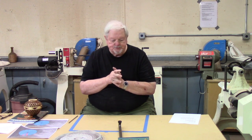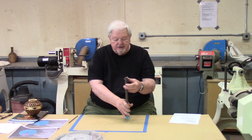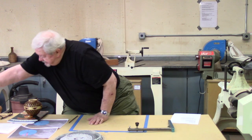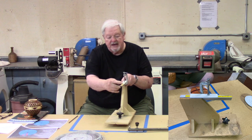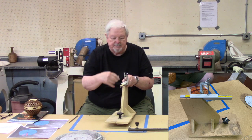And in today's video segment, which I'm going to run in just a moment, I'm going to show you how this is done by Bill Smith's classic way on the lathe. So you're going to see me set up an indexing plate on the headstock. You'll see me mount this device so that I can engage the right holes. You'll see me set this device up, which allows me to position each segment right at the center of rotation and at a specific distance from the center of rotation.